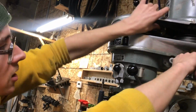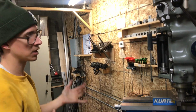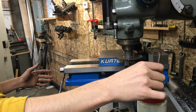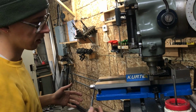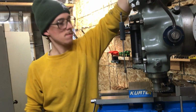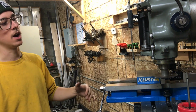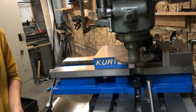I need to put the spindle into low range. So I want to cut at a very low speed. This is actually at 80 RPMs at my low speed. And I'm going to put just a little bit of cutting oil on my cutter because 4130 steel cuts pretty hard, and these are expensive cutters when you have to replace them. And now by feeding across in this direction, I'm pushing into the cut, and it's just a very stout way to do this operation.